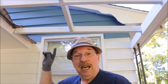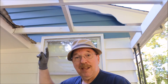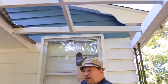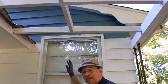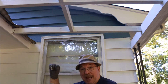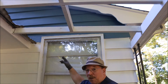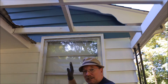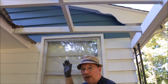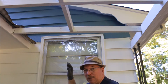I have to paint these boards and I also have to put up one more piece to make the crossbeam, because I want to have right here a 2x4 going across eight inches from the window. I want to give myself enough room to get up there and do some work on the window if I need to — take the glass out, get a paintbrush in there — and not have to do that funky flashing over the top of the window with a piece of masonite and aluminum foil. God, it was a mess. I don't know how in the world they ever thought that was going to work.